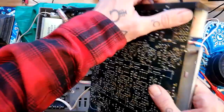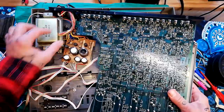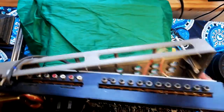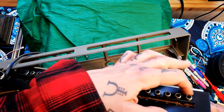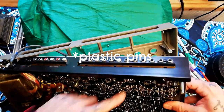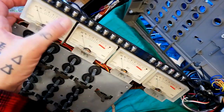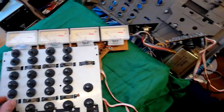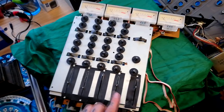Sorry I can't get a better angle for that. The whole thing is attached to this back plate here and that's a bit awkward — I don't want to have to remove the entire transformer. It looks like if I remove six plastic panels here then I can detach that mixer from this back plate. But I can't see any way to remove those pins without first desoldering these VUs. That's really awkward, so I'm going to have to leave it attached to that back plate with the upper case and the transformer and everything hanging off. It's just a bit of an oversight in the way it's been designed — it's not really designed with the technician in mind.